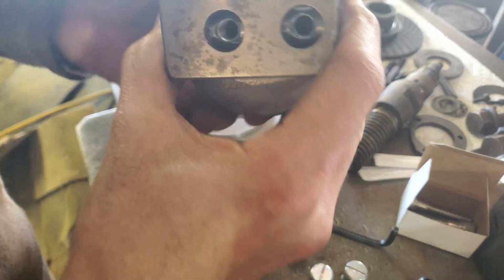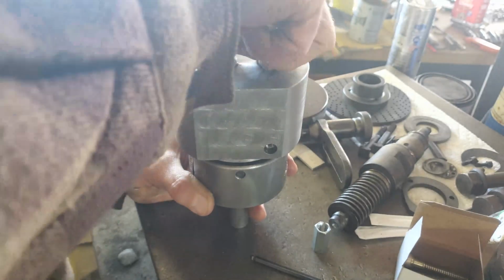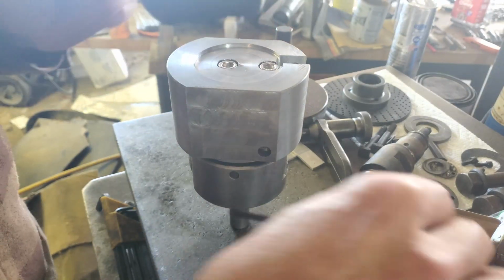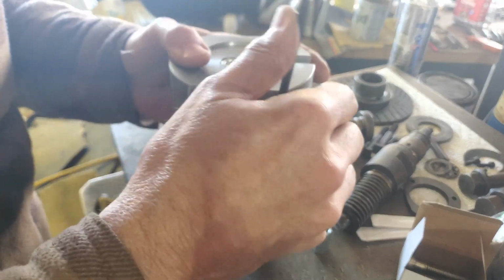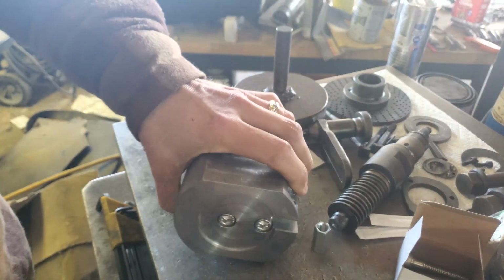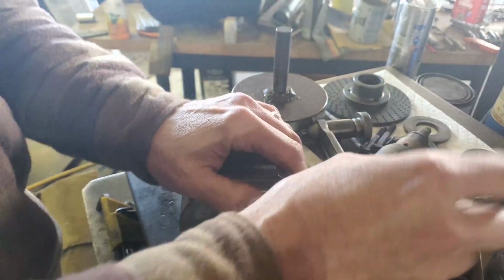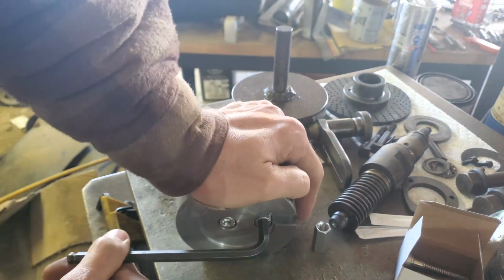I have both of my cross dowels positioned. I'm just going to get these till they're touching. And then I'm going to use this set screw on the side here to get good bearing on the thrust side of the cutting face there. And then I'll finish tightening down these. Might go a little bit even further in when I mount it in the quill.